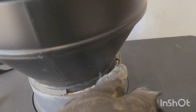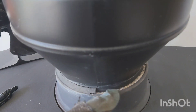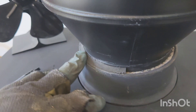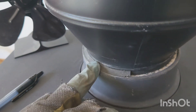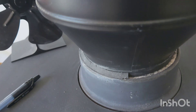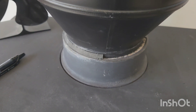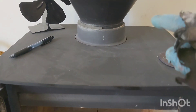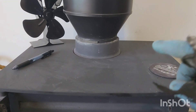It's not going to leak. If you're ever going to put fire cement in, always make sure it's the same level as the collar — don't have it at an angle. Because when the pipe expands in the heat, fire cement doesn't expand, so it will crack and come off. I go to jobs where they're replacing the fire cement every year — it's a nightmare. Use gasket rope, or put fire cement at the same level as the collar and don't go any higher than that.